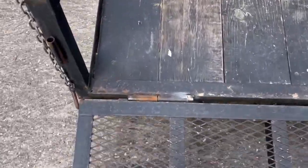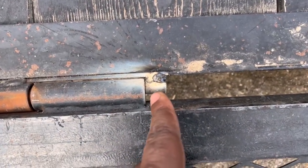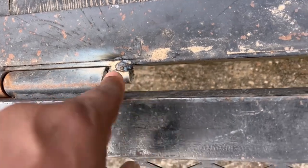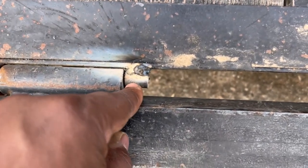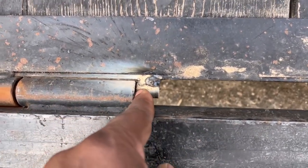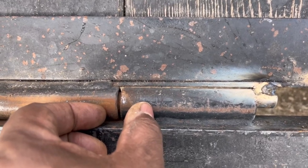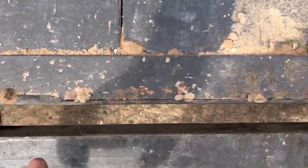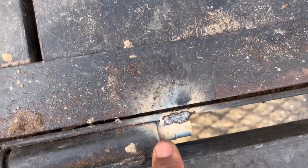As you can see right here, this part was sliding. So what I did is I just took a nut — or you can use an old socket from a socket set — and just welded it right there. This part was sliding to the right, so now I got this little bolt or socket there so when it slides, it'll hit this and stop. That gap before was about five-eighths to a half inch; now the furthest it's going to go is stopped by this nut. I put two on there — you can see I got one right here.